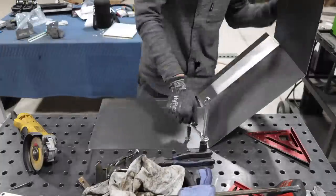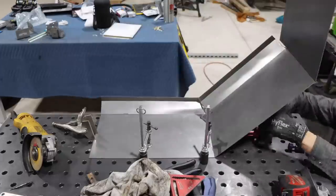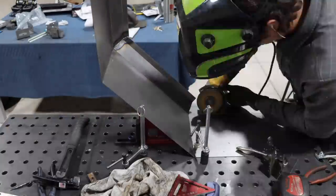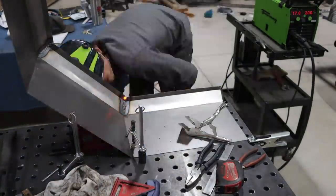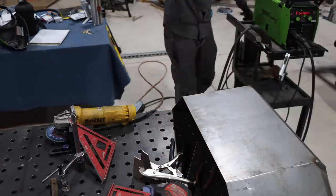The score lines make it a lot easier to put the bends in, but the problem is the material right where the bend is is definitely a bit thinner. So even in a couple of places after the powder coat there's just a little tiny split, and that's probably just because when they're sandblasting it there's just not enough material there to hold it.